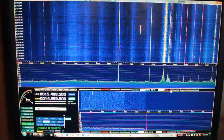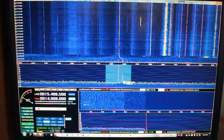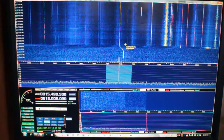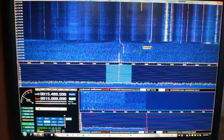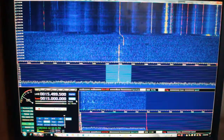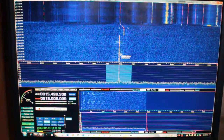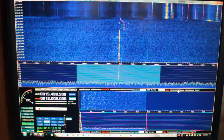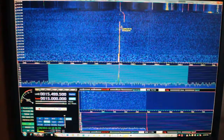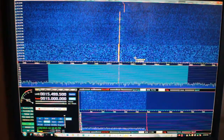Okay, we're back. Let me zoom in on this so you can see the WWV signal. I'm a little bit off there. With HD-SDR and SDR Sharp, you just click and it will auto-tune you, boom, into the center. See, I got that nice and trimmed out. It's a little work doing an offset and making sure your frequency trimming is right, but yeah, it's worth it. Once you get it right, you can't miss — it's awesome. There you can see all the sideband effect from the WWV transmission.